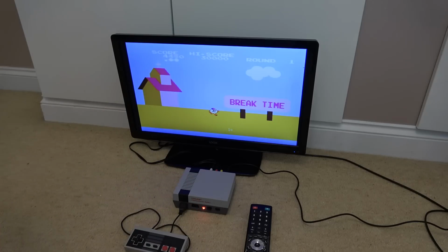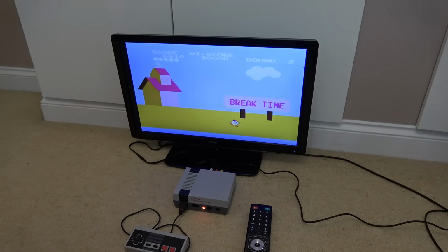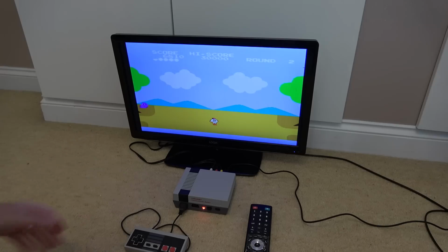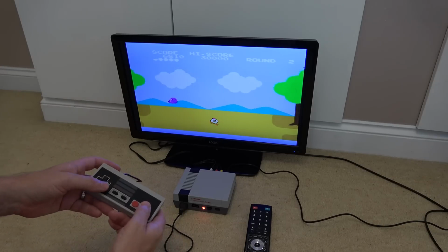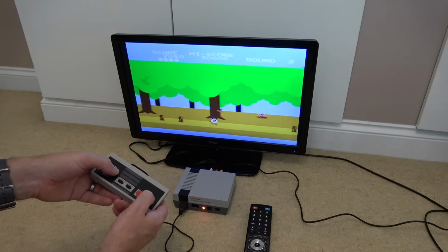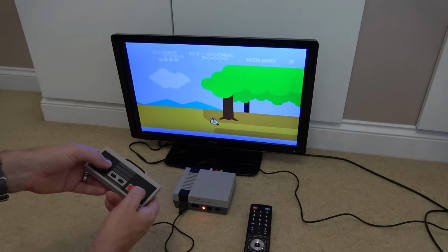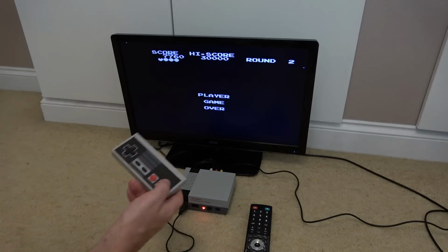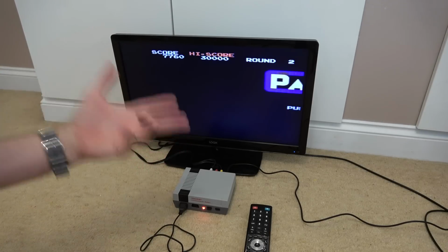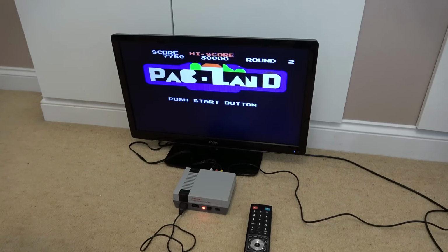Do you know what? I can't tell you how much I like this video here because it feels like I haven't had a fix like that in a long time, where there's not a million things wrong with it, or it's not something super straightforward. I had to do a bit of fault finding, and it shows you the importance of a visual inspection. Not even a multimeter was needed there. I know I was using the multimeter, but all that was needed was your eyes to see that the resistor wasn't quite in place. But yet you think it probably was okay, but that's when you needed the multimeter, because you could see that there wasn't continuity. I thoroughly enjoyed that one.